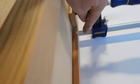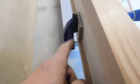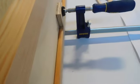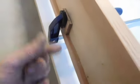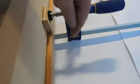So you have to sand those blocks flush because they sit proud of that by 1/8 of an inch, or 1/16 on each side, depending on the center of the spar. It's not quite centered, so it might be a 1/16 and a hair less on one side and a 1/16 and a hair more on the other. But you're going to sand these so that they're flush, because that is a jury strut, piece of metal. It's going to go right across there on both sides to hold the jury strut. So those have to be sanded so they are right flush with the spar.